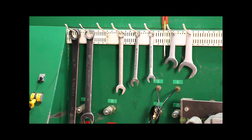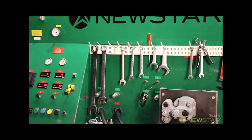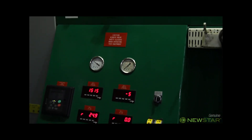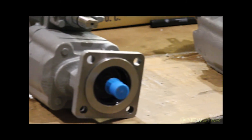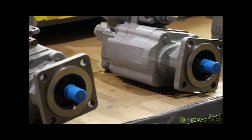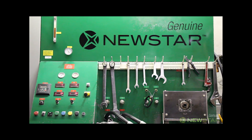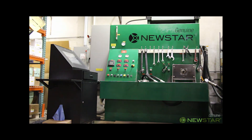This one-of-a-kind hydraulic test bench was custom engineered for S&S. It incorporates manual and automatic testing and uses quadruple filtration that removes particles as small as 10 microns. A series of valve controls and regulators precisely measure all pump functions. The 100 horsepower motor can drive pumps up to 1750 RPMs in a matter of seconds. Interchangeable mounting plates and a variety of supply hoses allow it to adapt to any style pump.